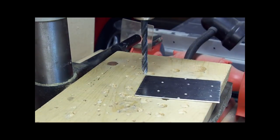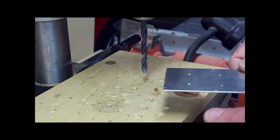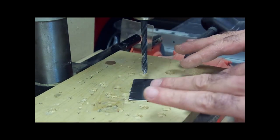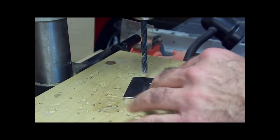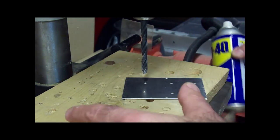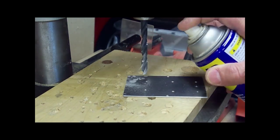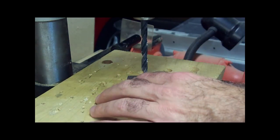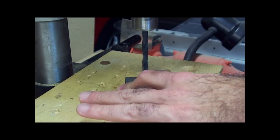Alright, we're back. We're going to go ahead and drill our 5/16 holes now. As I said before, I didn't use any cutting oil for those guide holes, but for these holes I am. One of the nice things about this material is it's a little harder and so it machines nicely, and the cutting oil really helps. What I do is soak the bit with the cutting oil and then go ahead and drill that out.